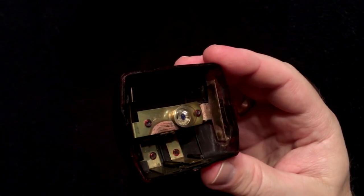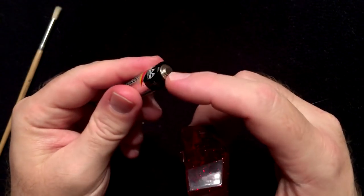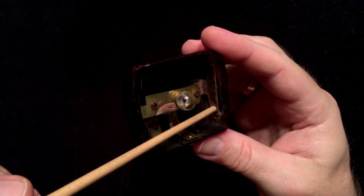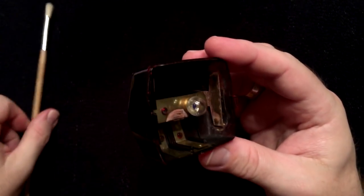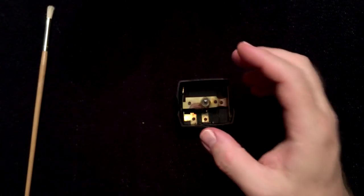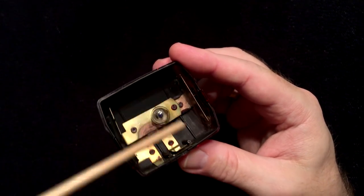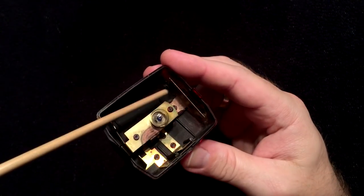So it's made to accept the positive end of a battery that has the little bump on it. And then this side has a little raised area here in the copper. So that's meant to be up against the negative side of a battery that is flat. So since there's nothing sharp about either of these, I'm going to guess that most of our connection issues are right here.